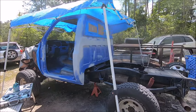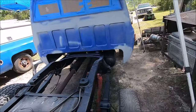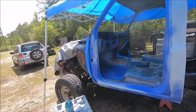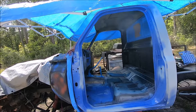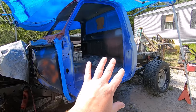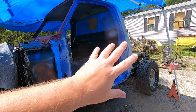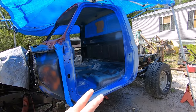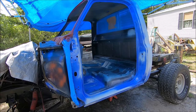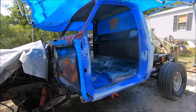After much, much, much sanding, I think we might finally be ready to give this thing a coat of paint. I cleaned and lightly sanded the inside — you just need to get the surface scored up a little bit so it grips the paint, and clean the floors out. When I do this, I'm going to spray the inside first so I can get my gun settings right. I'll start on the floor so I won't waste paint as I'm getting set up, and then when I finally get it right we'll start moving to the outside.